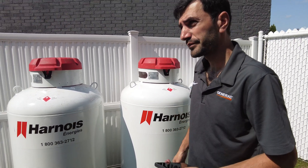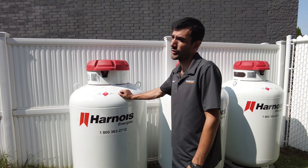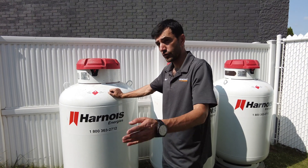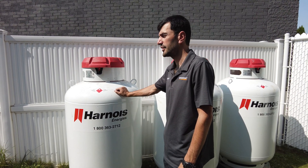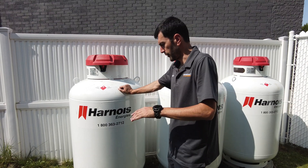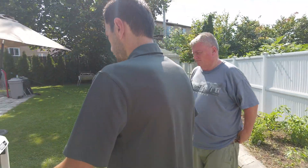You think there's about a day and a half or two? About two days — it all depends on the load consumption. If it's full load, using everything at 26 kilowatts, it runs about one day. But that doesn't happen — you're not using 100 amps all the time. It goes up and down, and the generator speed changes based on the load.